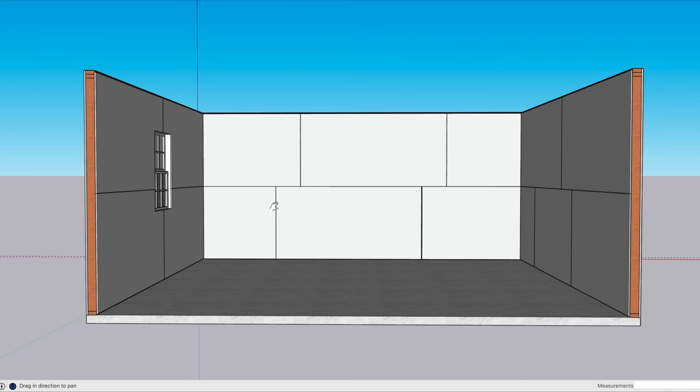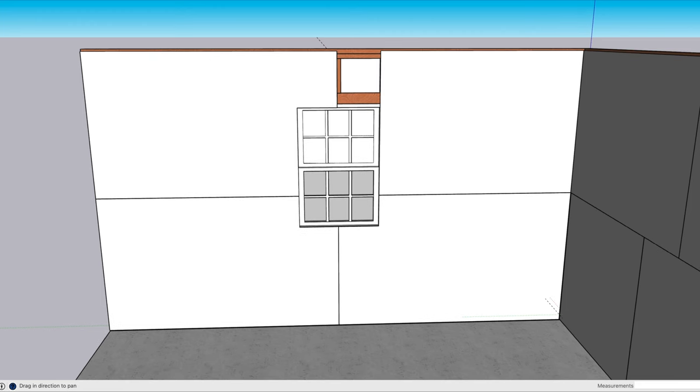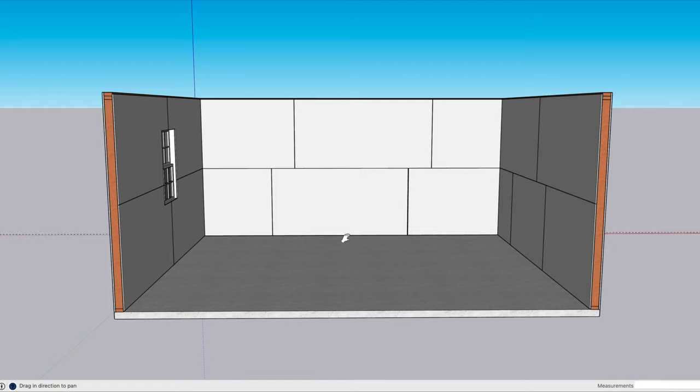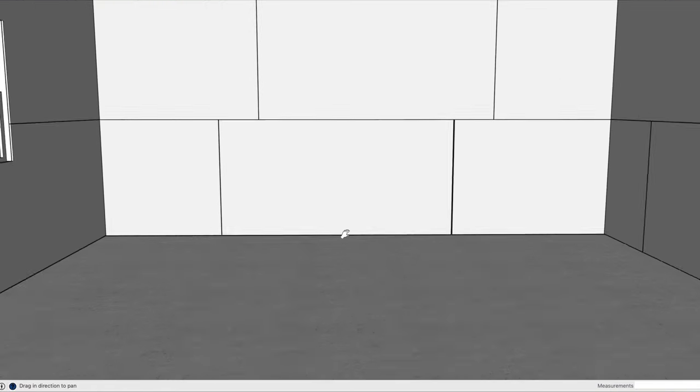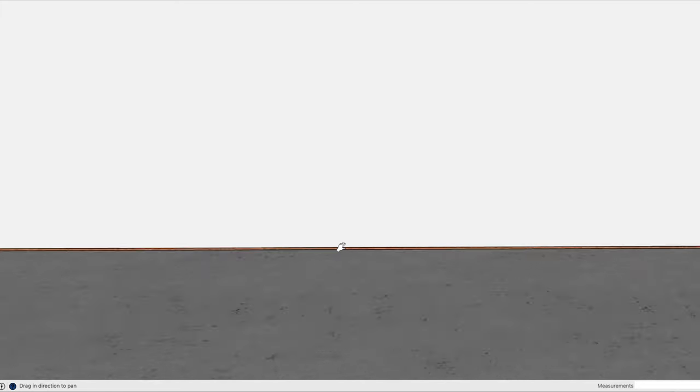This helps to improve the strength of your walls. Place any seams over windows and doors in the middle of the opening instead of at the corners to prevent cracking. Leave a half inch gap or so at the floor. You don't want drywall touching the floor to prevent moisture or water damage. A foot lift or spacers can help with this.